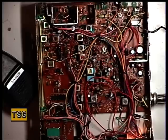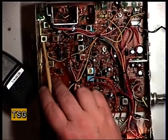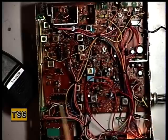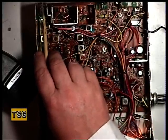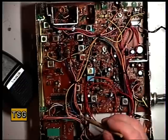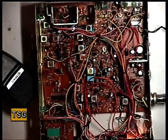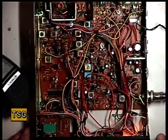This video will have to be uploaded as it is with two problems: the meter's not reading properly and it's off frequency. But there you go - the transmitter: there's the VCO, we're looking at T8, T9, and T10 for the tune-up, we've got the low power preset there, we've got the deviation at RV2, the frequency adjust is coil T6, and the reference crystal is there - and in this case that's out of spec. So we'll leave it at that, and tomorrow I'll see if we've got time to finish off this and do the receiver. It's not often that we don't complete one in one session, but there we are.